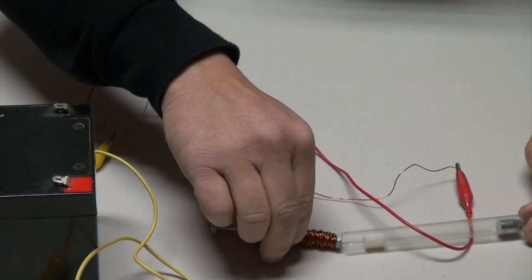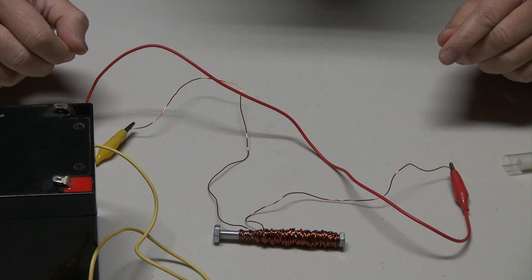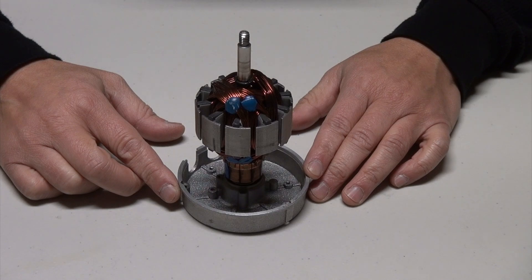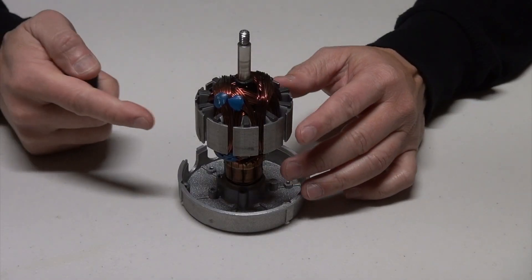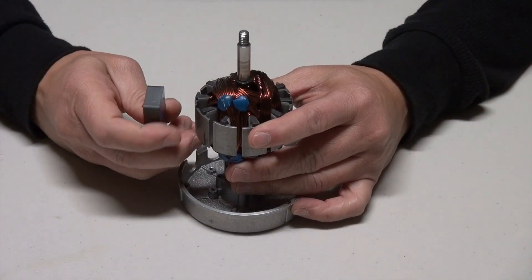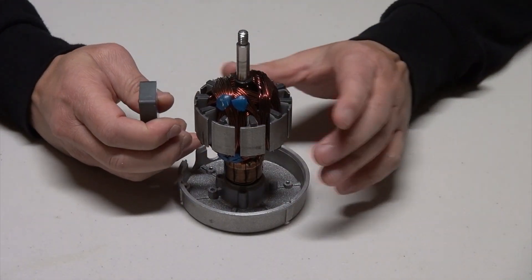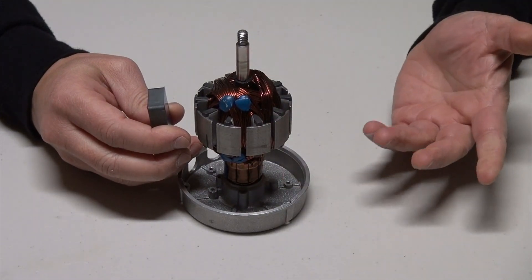With this concept, we can apply the magnetism concept of push and pull to make movement. How does this apply to the actual motor and the interaction between the rotor and the magnetic fields of the stator assembly? Here's the rotor — it is not magnetized yet. When it's not magnetized, it remains just a piece of steel. Even with magnets close to it, it will not rotate; it would just stay still, although there is attraction between them.